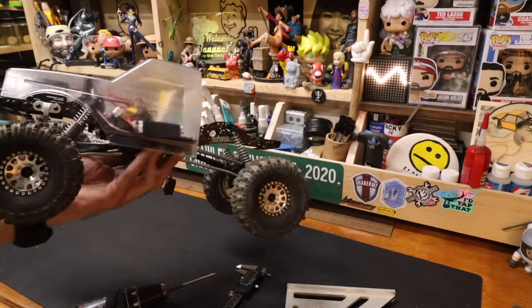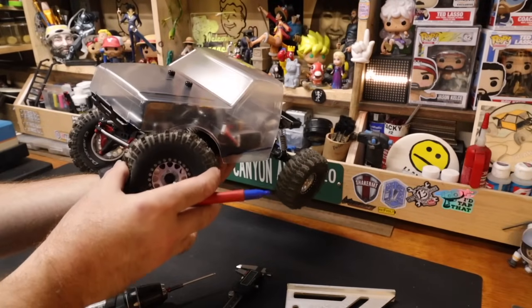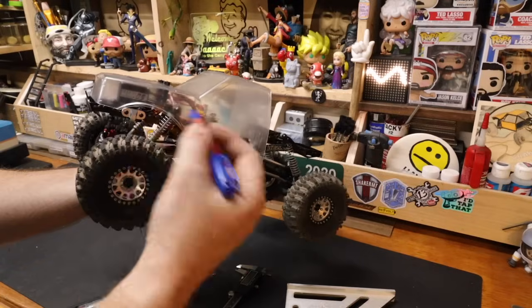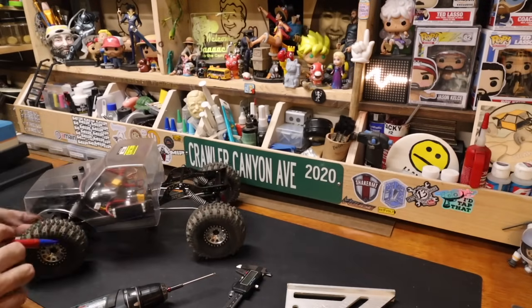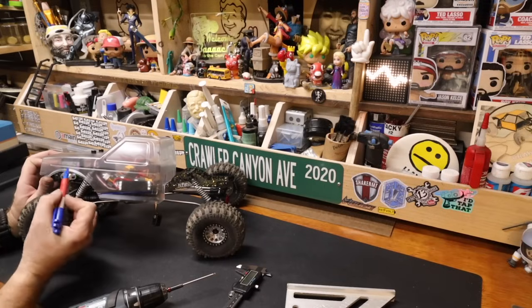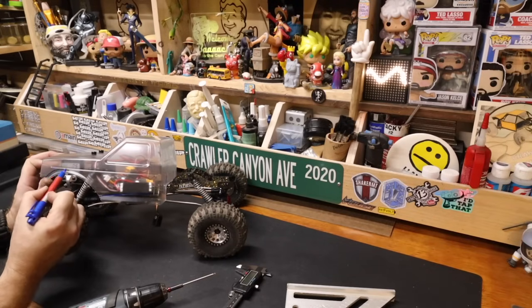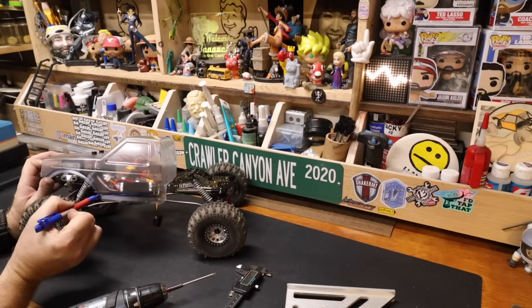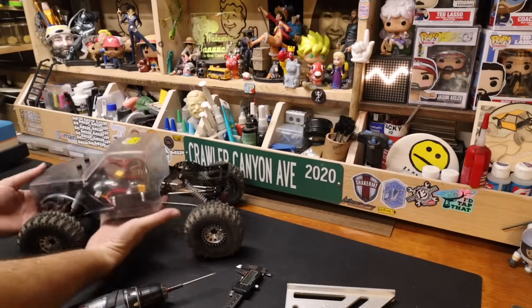And why I wasn't ready to drop it even lower is because under compression, particularly at steer angle, we're gonna have to kind of kill the look in the front, like it still has that fender line. So what I'm gonna do is, the flare will be gone, but we have this line. So we're gonna go from right behind the headlight, we're gonna go up right like this, just to the bottom of that line, and then we'll taper it right back down about to where the tape is right there. So that's kind of the cut lines, because it kills me to really chop these up.